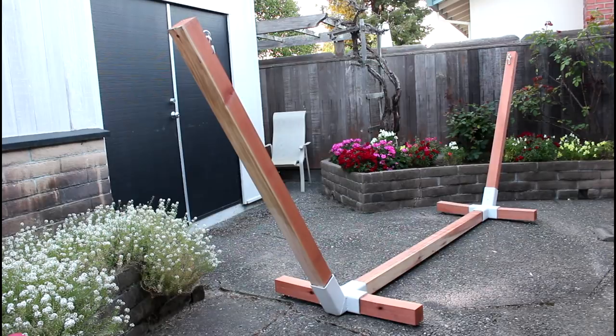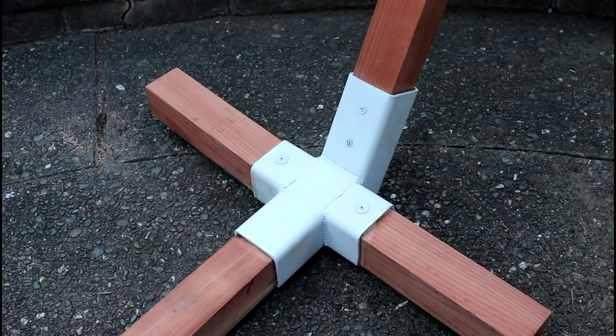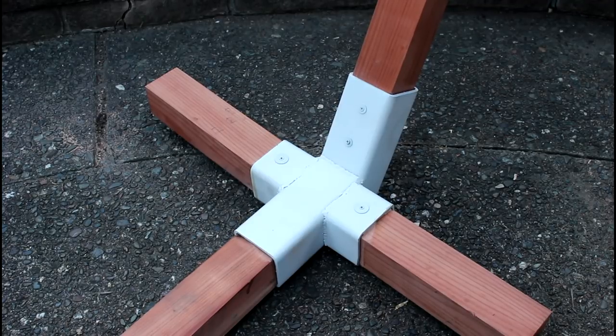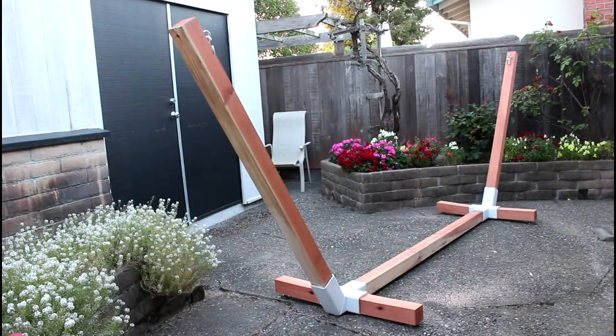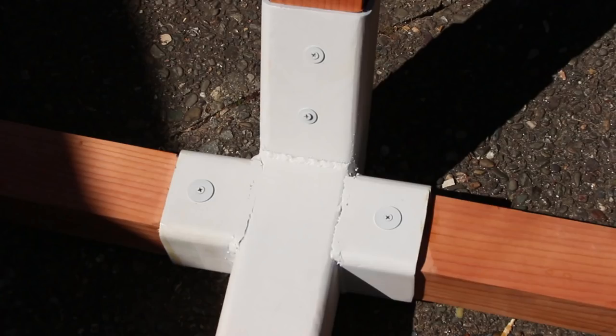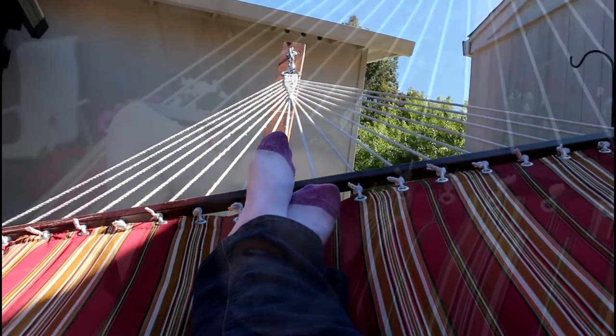This is not its final home — we're actually working on redoing our backyard and it'll have a place in that. The stability really does come from the steel, but this has been shimmed so there are shims in here to wedge it in tightly, and I've got four screws through the steel and into the posts. I've also added hardware for the hammock. The only thing holding up this hammock stand right now are those four leveling feet, and that makes it incredibly stable. I am extremely pleased with it. I'm very happy with my first attempt at welding. I left in a lot of the welds not just because I'm lazy, but because I wanted to be able to look back and say this was my first project — and honestly, for a first project, I'm going to call this a success. I really like the way this looks, I love how stable it is, and I'm really happy that it's done. Thank you very much for watching — I'll see you guys next time.